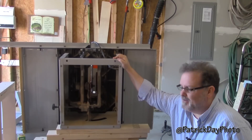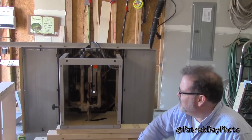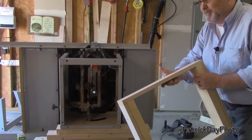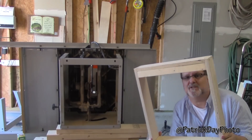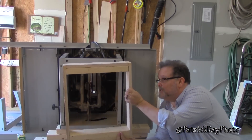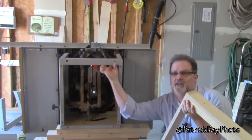Looking at the underside of the table saw, I was able to take it off the base. I'm using the cabinet itself as a support. The way the frame attaches, it's got essentially a set of bolts here. With every project you're going to have some design changes — my original frame holes didn't line up quite right, so I put a 2x4 in there. The goal is to line this on the bottom, draw marks on the base, then drill some holes and bolt it in from the bottom.